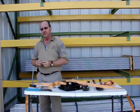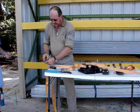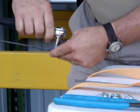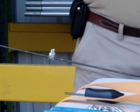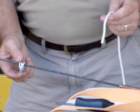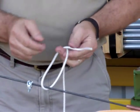Now, some of you have asked about how to attach the cord to the rod. I'm going to show you our preferred way of doing it. First, we're going to take a cable clamp and slide it on — you'll need to take the clamp apart, then snug it up. We're going to take our ratchet and tighten the clamp. Then we take the AMT 3-16ths cord — we call it no-stretch cord. Instead of putting the cord under the clamp where there would be compression on the cord, take the cord, go around the rod, and we're going to tie a simple knot called a slip knot.